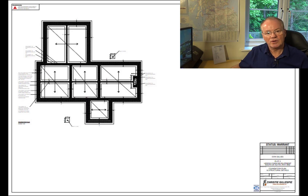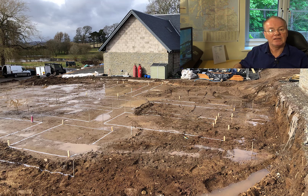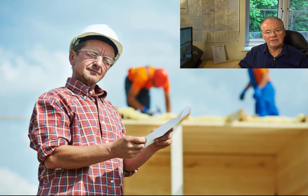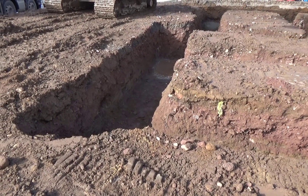What we need to do now is take the drawings the engineers prepared and make them useful to the ground workers — essentially taking the drawings and mimicking them on the ground. This is important because the building inspector is going to expect the house to be in the place stated in the planning drawings and the building warrant. The engineers also need to know exactly where to dig out the foundations and place the concrete, and we don't want to use more concrete than necessary, as that adds to expenditure.